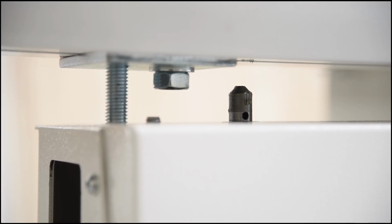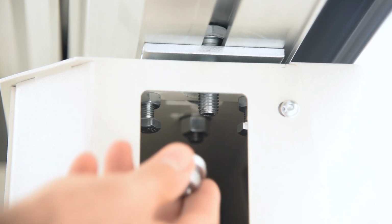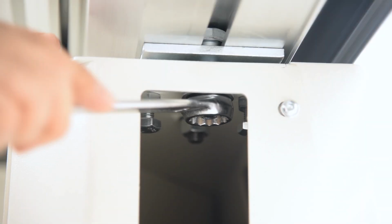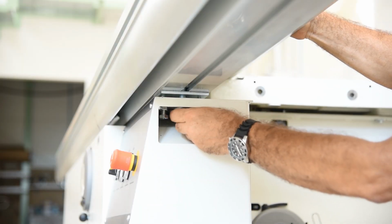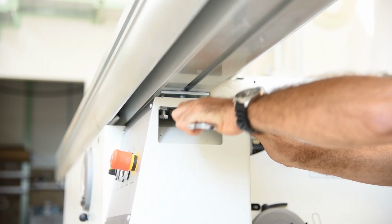All you need to do is make sure those pins seat in the slot on the underside so you go right back to the factory settings. Once you have the slider in place, you will want to install a washer and nut at each leveling point. On this saw, there are 4 of them. The front and back ones are accessed through a cutout in the steel cabinet. There are black covers that snap into place when you are done to keep them concealed.